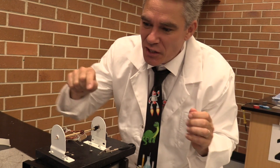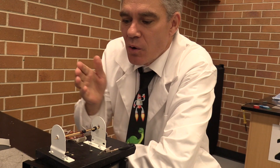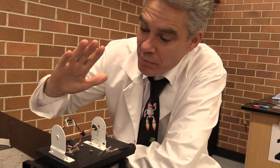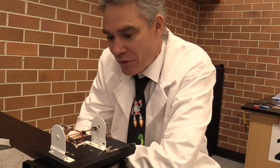I've done the modification — the magnets are now glued right next to the coil, so that the current in the coil will experience a maximum force the whole time, and the force will always be perpendicular to the axis of rotation. Let's give it a go.